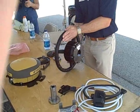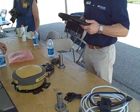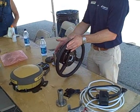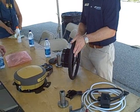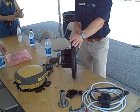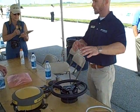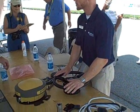The steering wheel has a flat look to it, so the first thought is that it's going to stick four inches closer to you. But every factory wheel I've seen on older or newer tractors is conical — they're all angled in. So when you take a factory wheel and put it right in line with this, the mounting is at the same point. The steering wheel actually sits at the same height as the factory steering wheel. So your tilt, telescope, and all functions, as far as the tractor's design, are the same — nothing's changed, other than you have a different steering wheel.